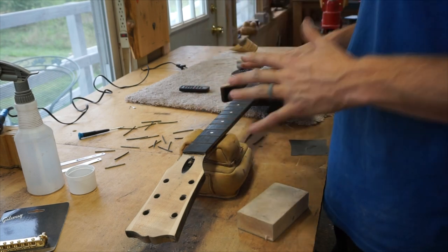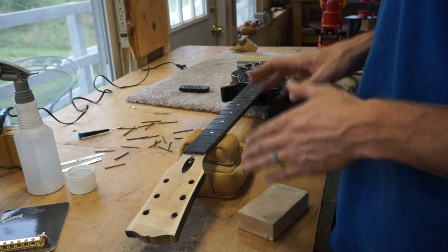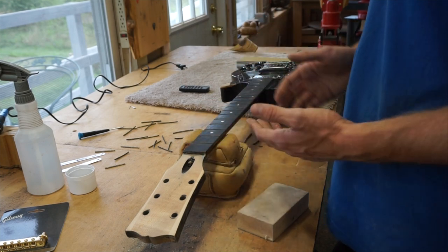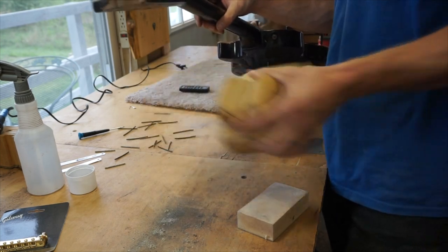So then once we put the frets in, I'm still going to do something probably to level the frets a little bit, but honestly I might not even need to level at all because I'm doing my leveling at this earlier foundational stage. So now, as much as I like this rifle rest here for a neck rest, it's too soft for what I'm doing.